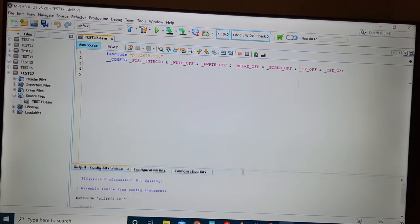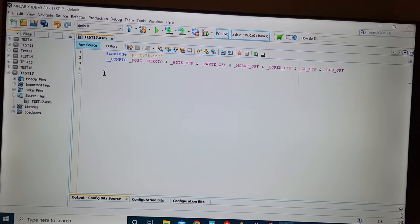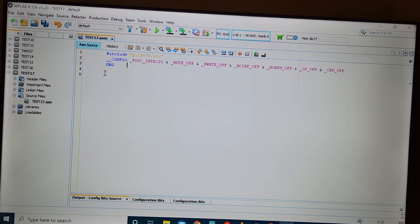I'm going to pull down the split window and start to program our code right here. With this program, we're going to first do one other statement to the compiler — we're going to tell it that the origin of our code is zero. That's where I want my code to start in my chip. I'm going to shift the code over here because I want to leave some space for a label in this section. I'll give a bit of space between all of this stuff and my program, which will be very simple — just a simple LED flashing on and off.